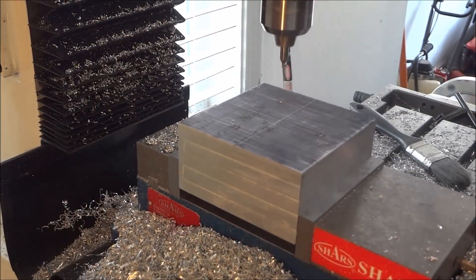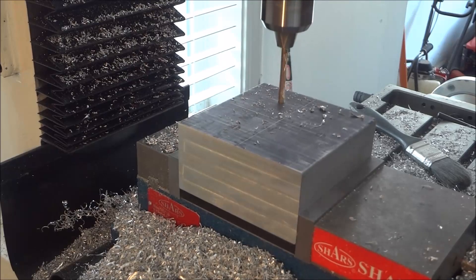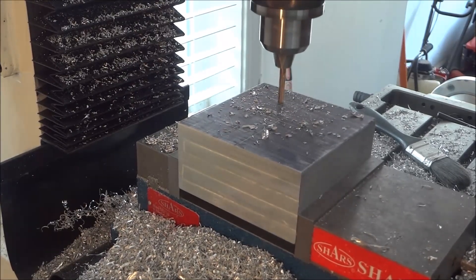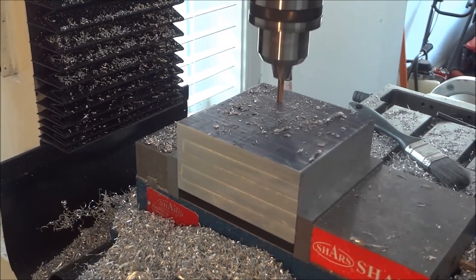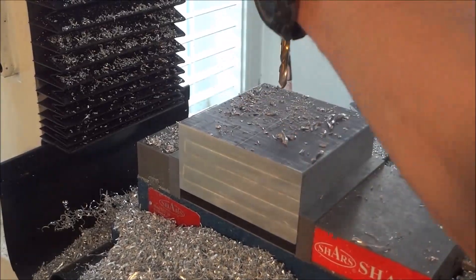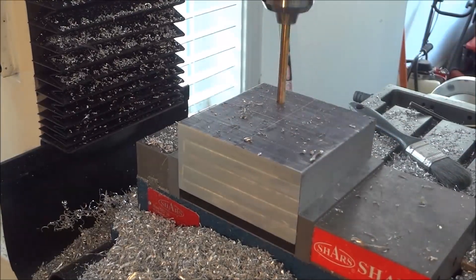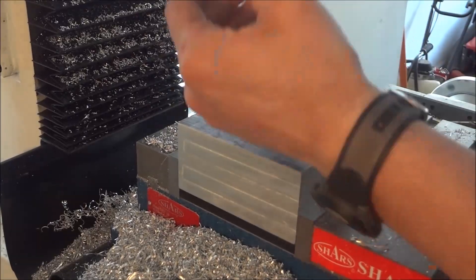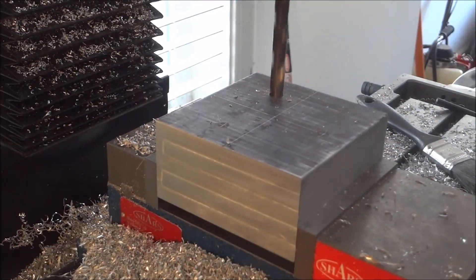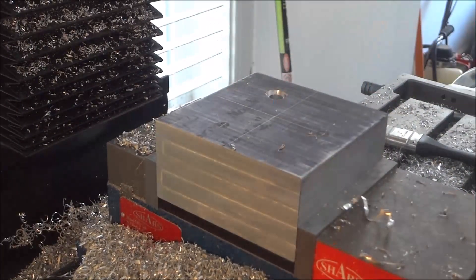Just as before, I've got a center drill here and I'm just going to center drill my hole and bore the hole for the mounting holes. The reason I center drill, then change the bit out to a drill bit, then put a boring bar in, is because once I get the hole lined up I lock my gibs down so it doesn't move, and then I just bore each one of the holes that way. That way I don't have to worry about it moving. It takes a little bit more time, but that's just the way it goes.